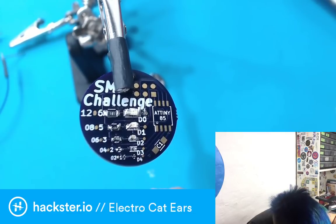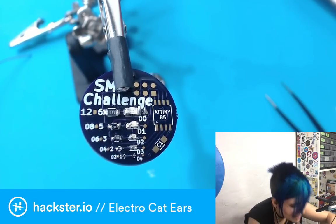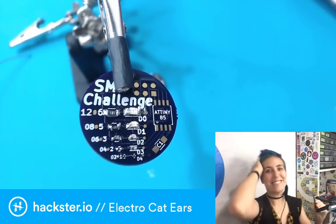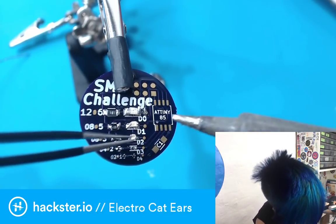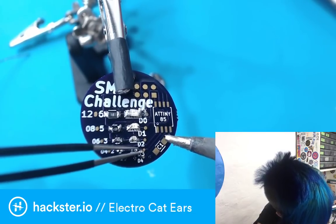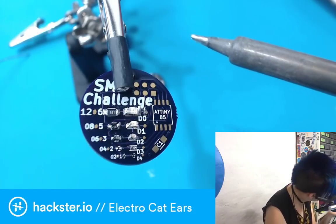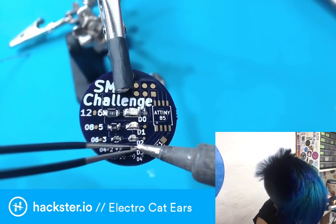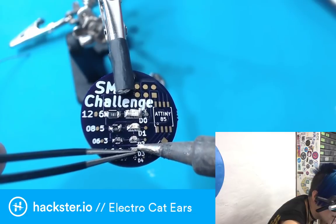Next up is 0402. I think I'm just going to barrel through because I don't want to stop once I've got my groove going. We're going to have to test this one again — I don't know how I'm going to test the last one; it's going to be a challenge. Oh, so tiny! One side has a little sort of arrow kind of edged into it. Let's test this with our little tester again — if my hypothesis is correct, it'll light up. Yes! Good! This is the green LED — it just lit up real tiny. Don't drop it. Shaky hands become a big issue at this point.